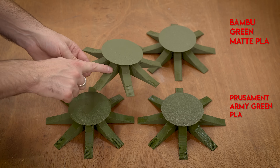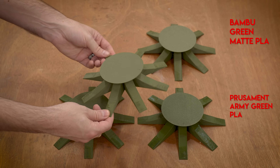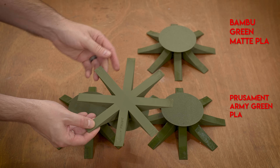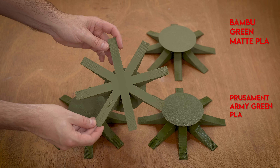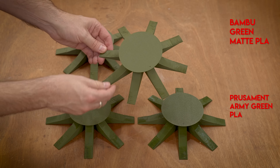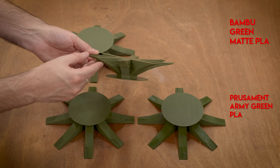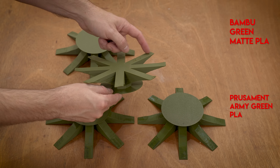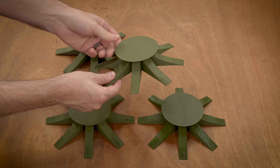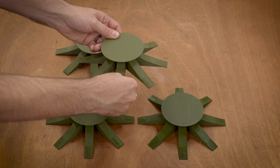This third one is the matte print. 70 degrees looks pretty good — pretty solid in most places — though it gets away from it in a few spots and the 75 just never really looks super good. The top surface is definitely very rough in some spots. Matte PLA is always a little bit trickier to get a good surface finish. Then finally the fourth one — this is probably the worst of the bunch out of all four. Lots of curling on the top; all of the tips are just curling up in the air. Very rough surface finish. It's okay in the middle but once it gets out to the edges it's really, really rough. 70 degrees was mostly okay with a couple of issues, and then the 75 is really, really rough.